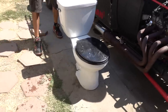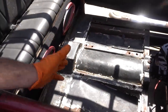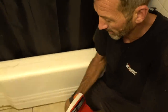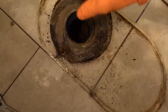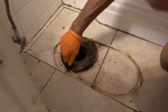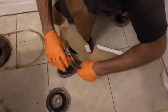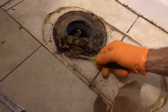This is your wax ring. What you guys were all worried about — that's actually the wax ring. That's just wax. Your poo poo is going down there; it's not going on this. If it's going on this, it's going out here and you've got a problem. So let's take this bolt out. This is the part where you're like, ugh — because you're kind of like digging. I open this box up so I have a place to put all this crap. We need to dig all of this out right here.